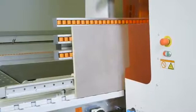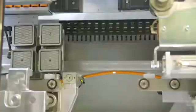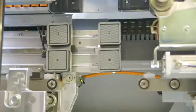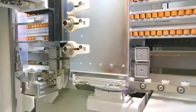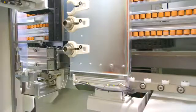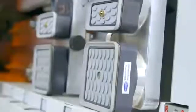Sturdy roller beams make for smooth and precise panel transport and support. The patent-pending workholding utilizing vacuum suction pods is software-controlled. The cups will automatically position themselves, allowing for machining of workpieces of up to nearly 5 feet on all four sides without reclamping cycles. Besides unmatched versatility, this system also makes for extremely short cycle times and precision on long workpieces.